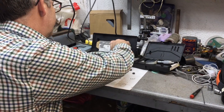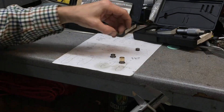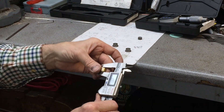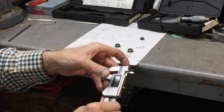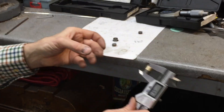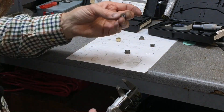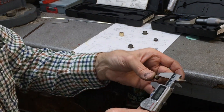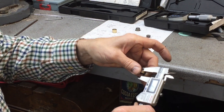Most people have calipers to measure. If you've only got calipers, you do need two buttons — you need one button for the closer. You measure it as a package to get your thickness. And then you'd need a similar button that sits inside there and sits out the other side. As I said, you can buy sets of those relatively cheaply on the internet. You do the same thing — you measure the button, zero it, pop the button in there, and then measure the whole lot.